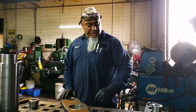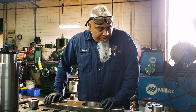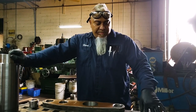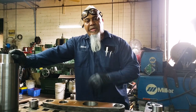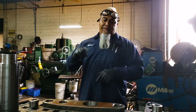So I can tack two of these in and fully weld them while they're on the table because it's easier to weld while it's here. Then we'll move on to putting the post onto the bottom plate. I'm going to tack that in place, and once that's done we're going to bring it over to the jig, set it all up, put my top plate on, tack that, and then we're good to weld.